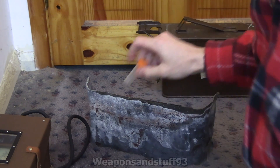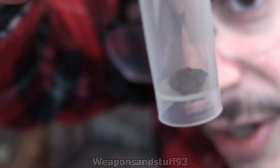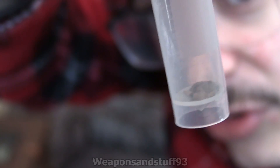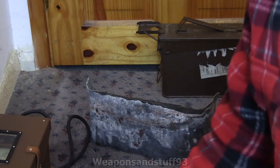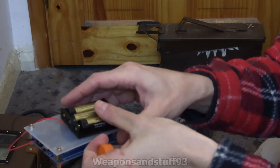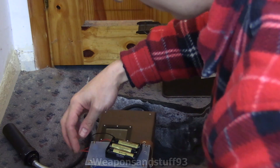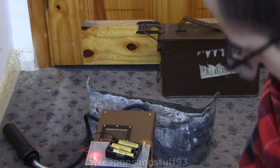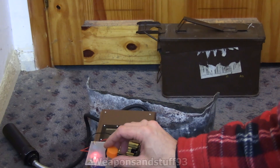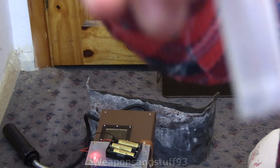This normally stays in the box, but this is where I've got a tiny, tiny bit - you can probably see there - of radium dust in the bottom. This is where I've had bits flaking off. You can see that's far, far less than a gram. When you sometimes get radium dials and they're flaking off, I've been very carefully putting those into an airtight jar. Let me demonstrate - I'll turn on this little DIY Geiger counter and you'll see just how hot a little bit of radium dust is. That's already detecting a load of radiation. This makes the mini-monitor max out at over 2K - just this little tiny bit there.